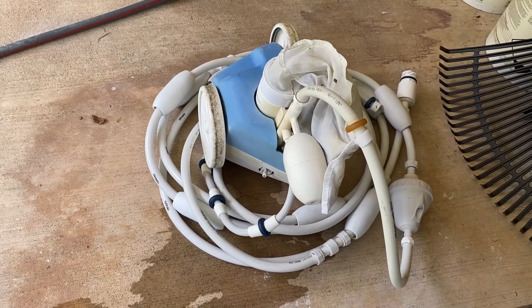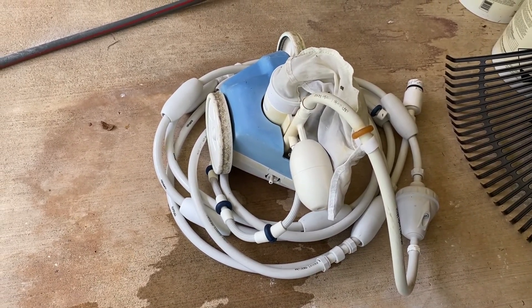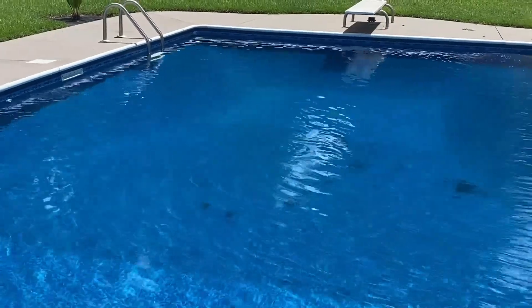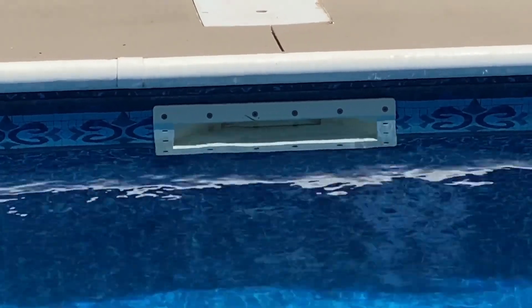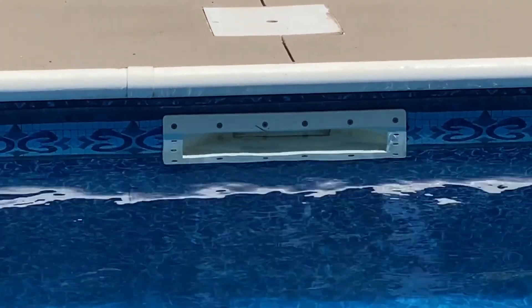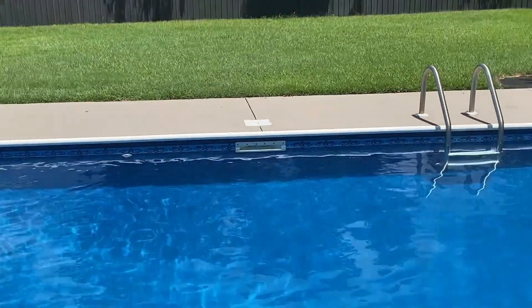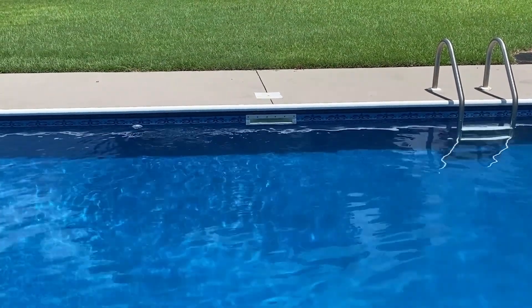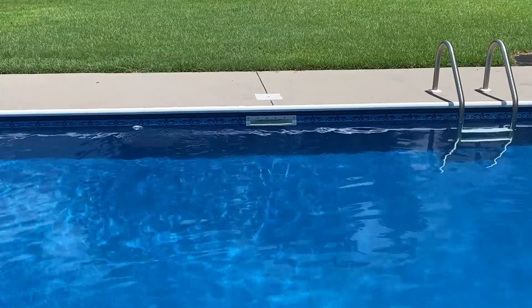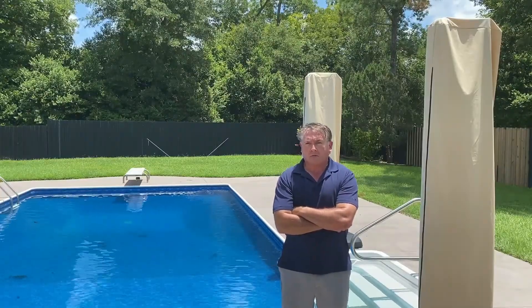This is my pool cleaner — it's a Polaris brand. It's what sucks a lot of the smaller leaves and debris off the bottom of the pool. Lastly, another detail I'm going to look at is water level. By the looks of the skimmer window, the water level is high. I like to set my water height about half of that window, because what you want is the top surface of that water to flow into the skimmer and start filtering out all the impurities that accumulate on top of the water. So before I do anything else, I need to lower the water level.